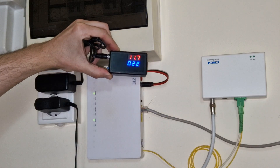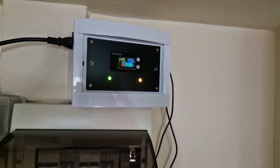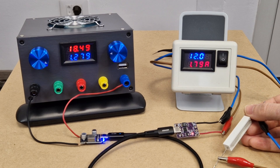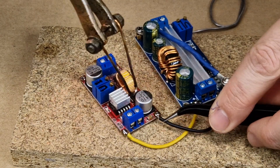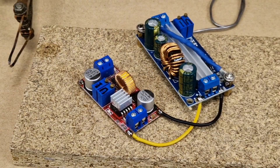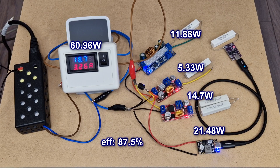Because the loads draw less current, the battery will be recharged very rarely, and I will probably never use 21 watts from the USB Type-C output. I also soldered all the wires instead of using the imperfect screw connectors. I've shown you all these calculations in case you build a UPS for other devices, so you know how to calculate everything to make it safe.